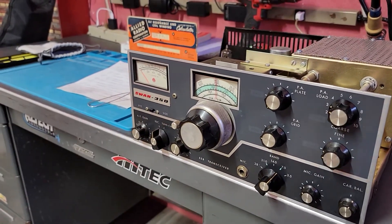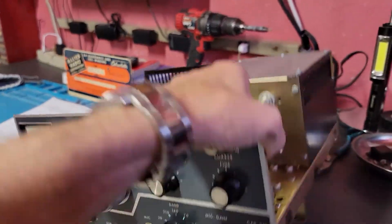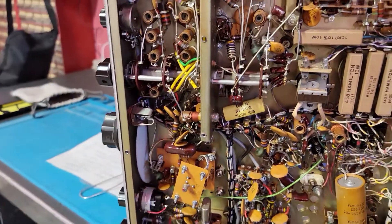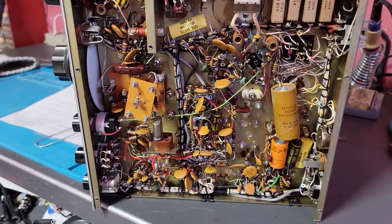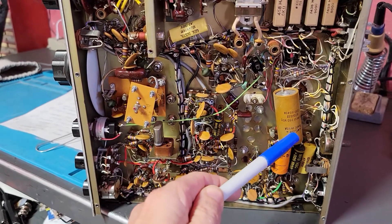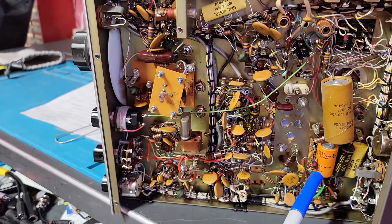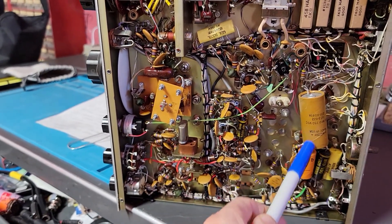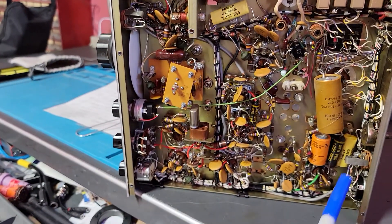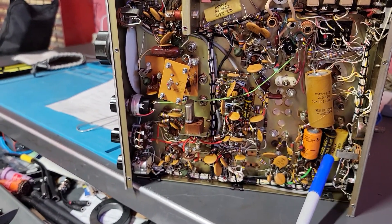Essentially, you're pulling off all covers and checking all tubes — I'll get to that, I'm not going to show you how to check tubes. You've got a couple of old caps in here and I'm going to replace those. I already have some pulled. That's an 80 at 150, and that is a 10 at 150. So I have 100 at 400 that I'm going to put in there. This one here is not an electrolytic — it's a .005 microfarad at 1600 volts.